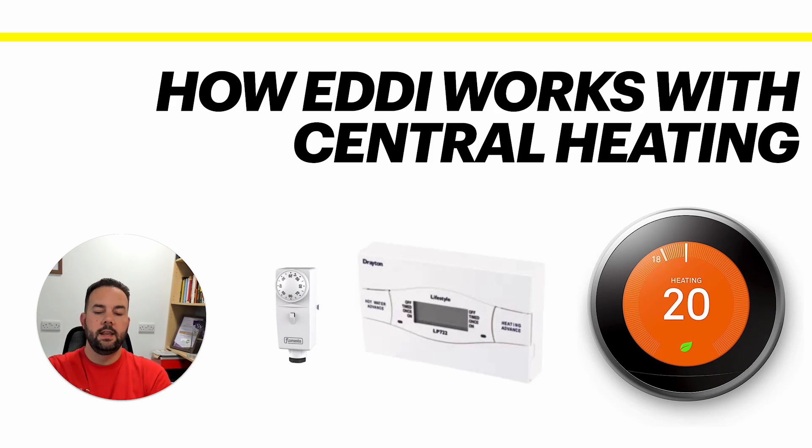If the electrics are already up to temperature, the gas boiler waits until you've used some hot water and then brings itself on afterwards. If the Eddie has been pumping energy in all day and the temperature is already up from electric, when the gas boiler comes on at tea time it's going to see it's already warm and won't need any gas. If the cylinder stat is set higher than the electric thermostat, it will top it up with gas — so if electric cuts off at 60 degrees, gas further heats it to 65 or 70. It works the same the other way around, letting them work alongside each other.